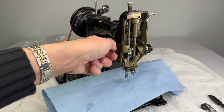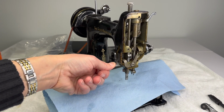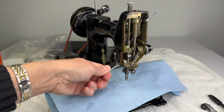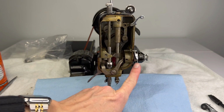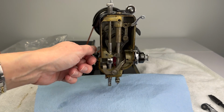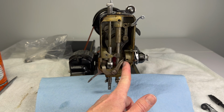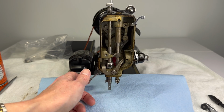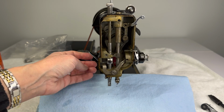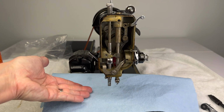So before we remove the tension pin releasing lever, let me explain to you what it does. If you watch when I raise the presser bar lifter, this whole part rocks forward. Now, if you watch my tension when I do that, you see that movement? So my presser bar is up. This tension pin releasing lever is pushing against the tension pin inside the assembly. It's moving it forward and taking the tension off of my tension disc, which means your foot is up, the thread pulls freely without tension, so you can remove your project from your machine.